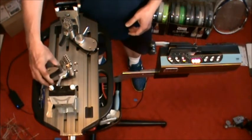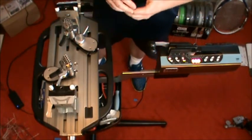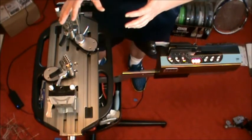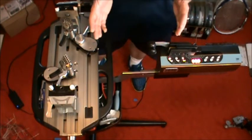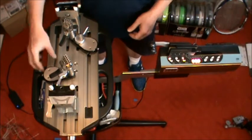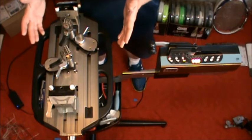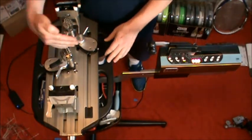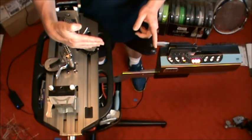Because you want to orient, you basically set up your turntable like you're pulling crosses. You don't need a racket mounted or anything like that. You don't want to run the string through any grommets or a frame at all, because that's going to introduce friction into the system and not give you the most accurate reading. So we don't use a frame, we don't run the string through anything. So orient your base clamps. Now if you have a glide bar machine like a Prince Neos 1000, turn it this way and turn the glide bar so that it's oriented like you're pulling crosses, and line up your clamp with your tensioner.